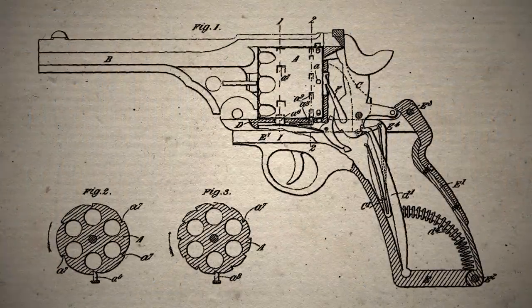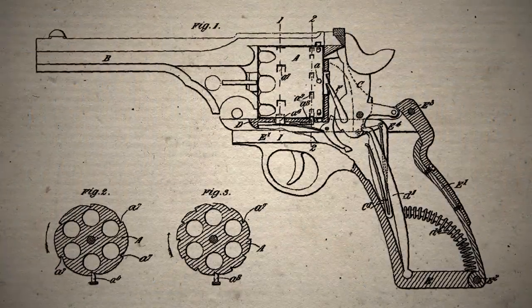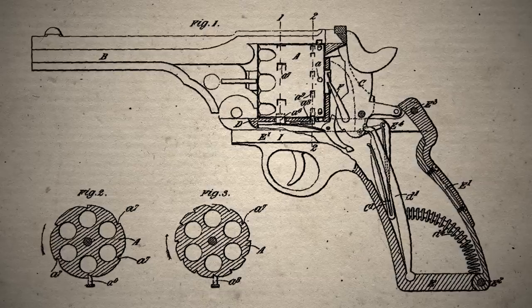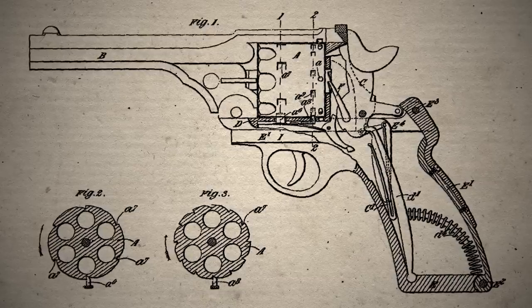At the same time, Fosbery had noticed that the initial jolt, the bang, of a fired cartridge being transmitted directly to the lockwork created far too sudden of a snap, and it tended to damage especially the hand, that little bit of metal that indexes the cylinder. His 1896 patent would therefore be built on a Webley frame, and now the hammer was cocked by an extension at its rear attached to a roller. This kept it inside the gun.